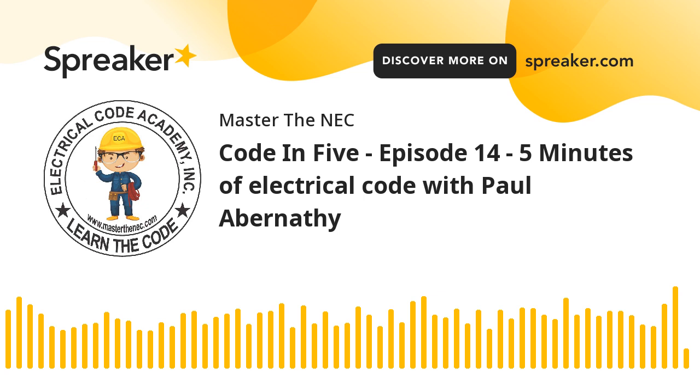Now, what if we have a situation where there aren't any KOs, there isn't any concentric or eccentric or oversized plugs — none of that is encountered? Well, if that's the case, then I don't have to worry about anything in 250.92B because I am dealing with a feeder after all. I can go down to the exception, and the exception says I can use a listed fitting. So as long as that wiring method has a listed fitting and it makes metal-to-metal contact — in fact, item number three says I can use fittings with shoulders, connectors which seat firmly against the side of the cabinet for things like EMT, FMC, and other types of cable connectors. As long as I'm making that metal-to-metal contact, I can use a standard lock nut on the inside to provide both the mechanical connection and help ensure that metal-to-metal contact stays in place.